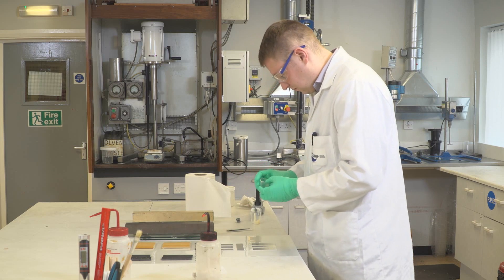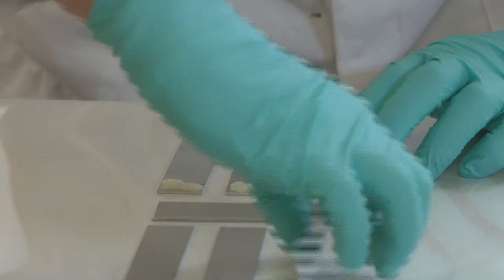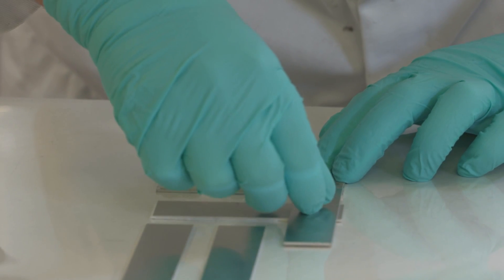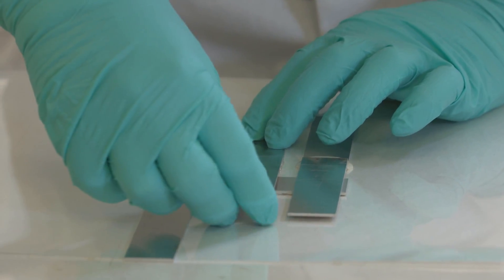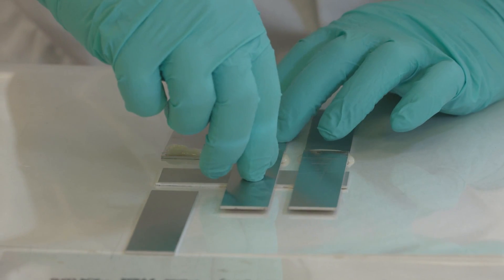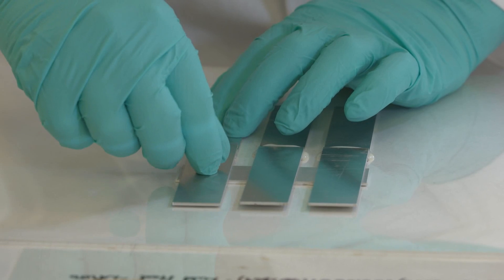There are a number of different MMA's with regards to mix ratio. As they are a two-component adhesive, you can have a one-to-one mix ratio all the way up to a ten-to-one mix ratio and more, depending on the technology developed. One-to-one products are high-strength adhesives with low elongation, compared to a ten-to-one adhesive which still has high strength but much more elongation.